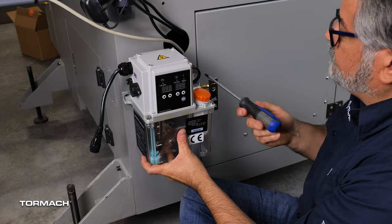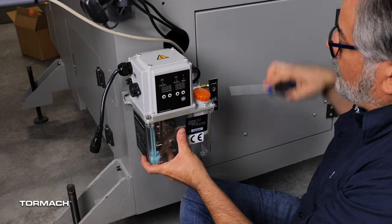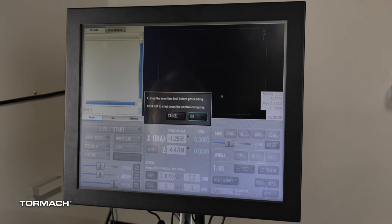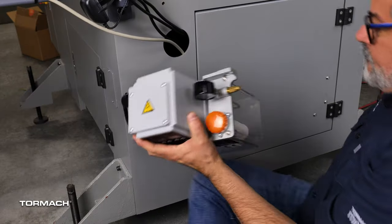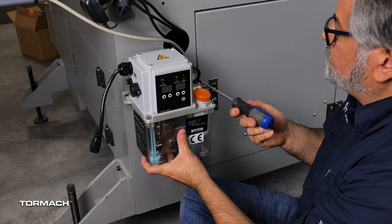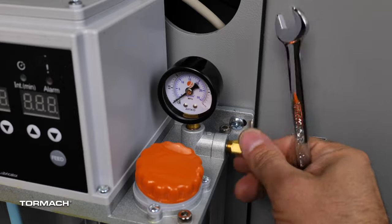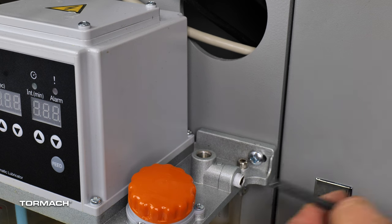Installing the automatic oiler. If installing on an already assembled machine, go through the shutdown procedure: click Exit on PathPilot, e-stop the machine, click OK on the pop-up dialog, and turn the power switch to off. The automatic oiler is installed underneath the machine arm. Use a Phillips screwdriver to secure the provided screws on either side. The pre-installed brass fitting will impede the door panel, so remove it with a wrench. Wrap some pipe tape around the threads of the small seal and secure it into the input with an Allen wrench.